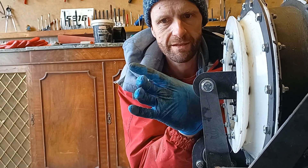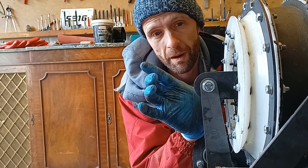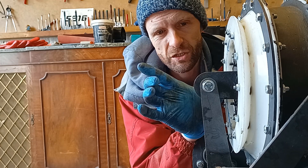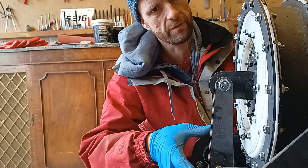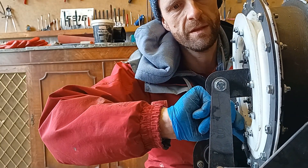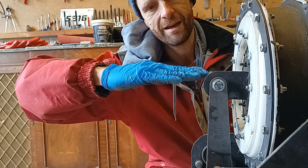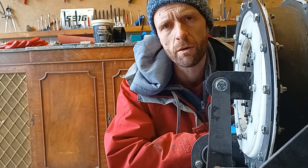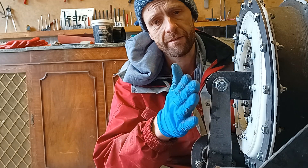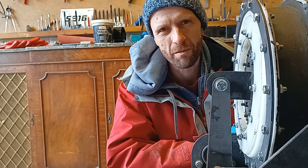The piston stability is a slight issue. I think given another shot I would have made this perhaps longer - I reckon that would have solved a lot of our problems. They do use diaphragm seals in water pumps but we have a slightly longer linkage, and I wonder whether that is actually the secret to the stability. At the moment the steel will pivot around like that, but if it's further out it wouldn't be able to pivot. The only problem is I'd have to change the geometry of the engine - change my angles. I'll look into it if it becomes a real problem but for the moment I'm just going to hold with this design and run it and see what happens.